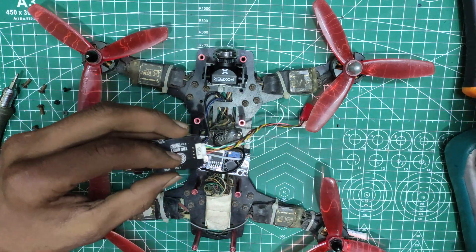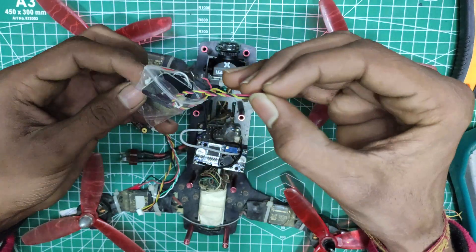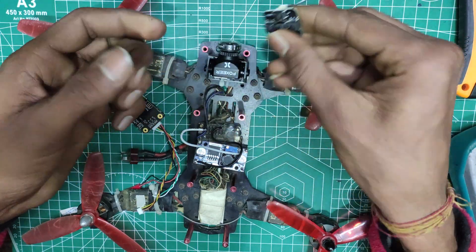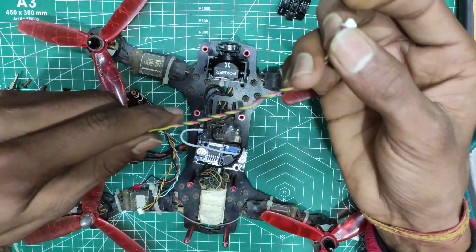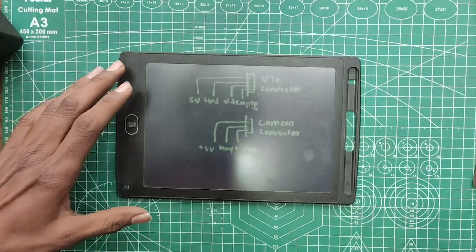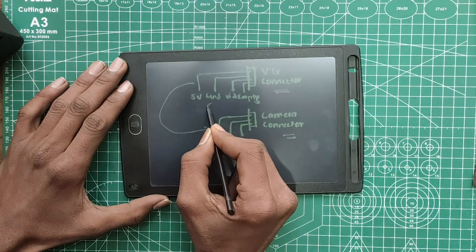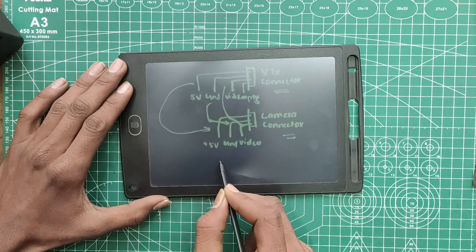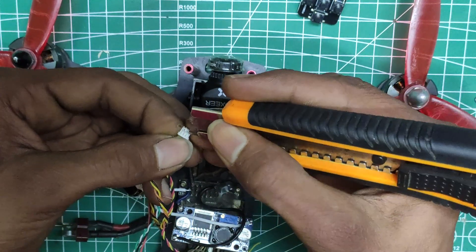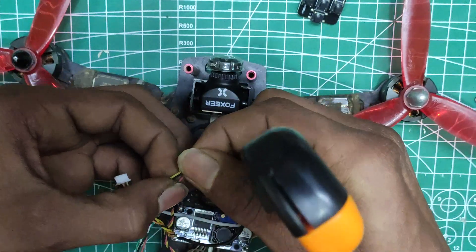Now we will need the wires to connect to the video transmitter, and if you look into the pouch that came with the camera we can find the cables along with the push buttons. For now we are only concerned about the connector with 3 wires. The connectors of the camera and the video transmitter are the same type, but unfortunately the video transmitter has a 4-wire connector slot and the camera only has 3. There is an easy fix though — we can move the wires from the video transmitter connector to the camera connector. With a razor blade and gentle hands it is not that difficult to do.